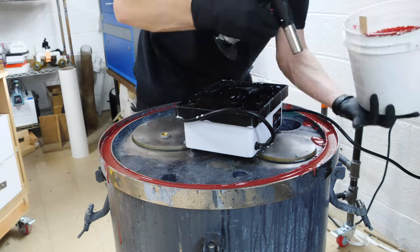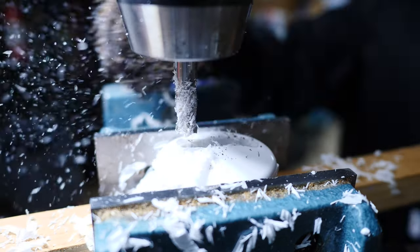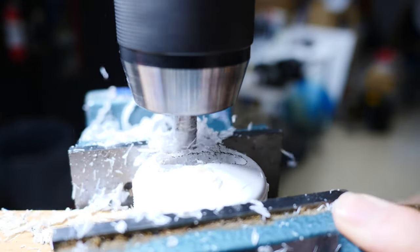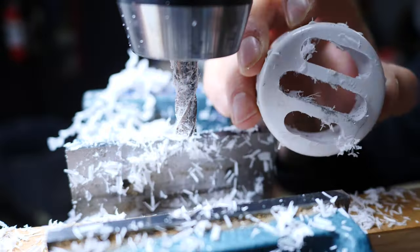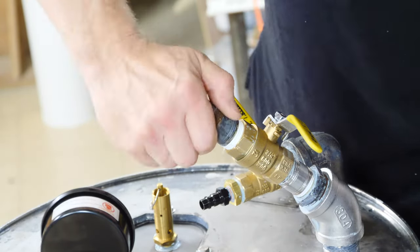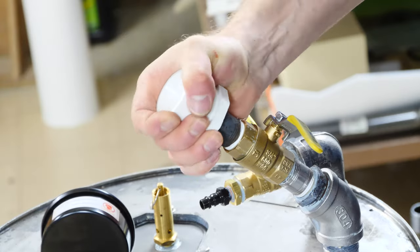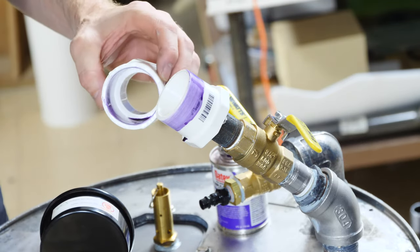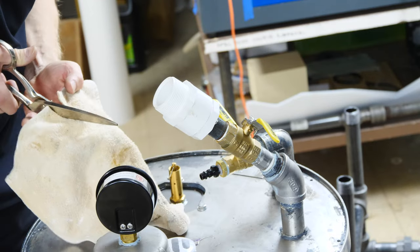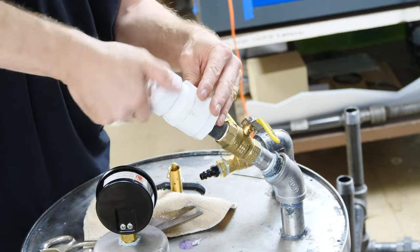I'm using a little torch here to pop any bubbles on the top surface. I need to build an exhaust vent muffler. For this I use PVC, and I'm going to mill out some slots in the cap of a piece of PVC on my drill press. I have a couple of videos about making these exhaust mufflers and plastic machining on drill presses. This is the exhaust so that I can fully open the valve very quickly, let all the air out, and keep the noise down so I don't have to wear hearing protection — it's a lot of volume of air that comes out of this thing. I'm stuffing in a piece of terry cloth in here, and that works really great to dampen the sound and slow the release of the air.